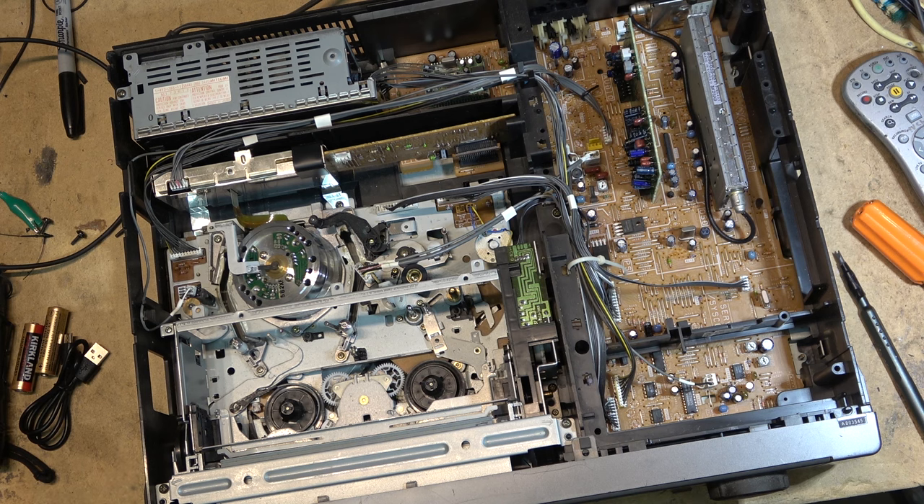The scope I'm using is an analog scope. If you've gone out and bought a digital scope you probably won't get good results, because unless you have a very expensive digital scope they are not going to display the waveform worth anything. I have a 100 megahertz, one gigasample-per-second unit that cannot do alignment worth crap - completely unusable. Most digital scopes not in the four-digit price range are going to deliver exactly the same poor results.